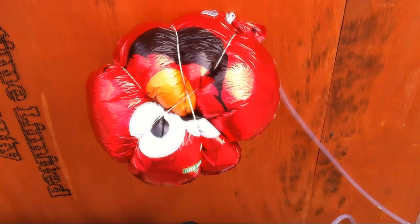That's our intro on biogas digestion. In a future video we're going to pipe this methane gas into a water heater to heat the greenhouse and the fish water, and also pipe it into the house to use on the gas stove. This effluent from the digester is being sent to the University of Missouri to test — the digestion process should have cooked off any harmful bacteria with no chance of E. coli, but we'll confirm and report back on how fertile it is and whether it needs to be diluted. We've also added rubber bands around the test balloon to keep it pressurized.